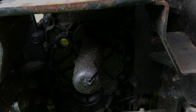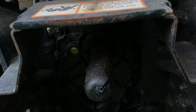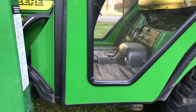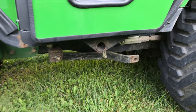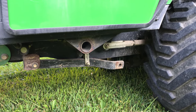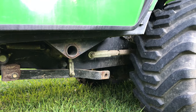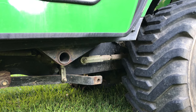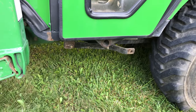A hydrostatic transmission does require hydraulic oil, and you'll want to maintain that properly at the right level. Also underneath a hydrostatic tractor, you're going to have a filter and a cooling fan. We did a video once where we broke the blades off of that fan and had to replace it — not a super easy task, but I did find a quicker and easier way to do it without splitting the tractor apart or taking the whole transmission out. I'll put a link to that video up above.